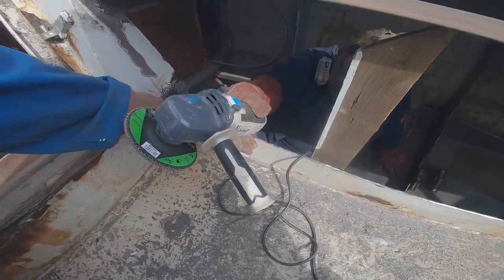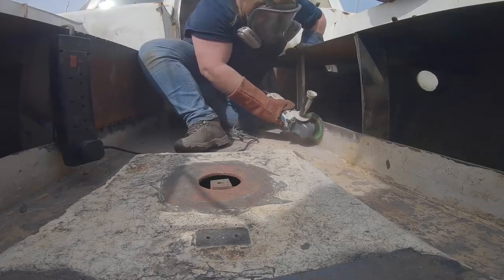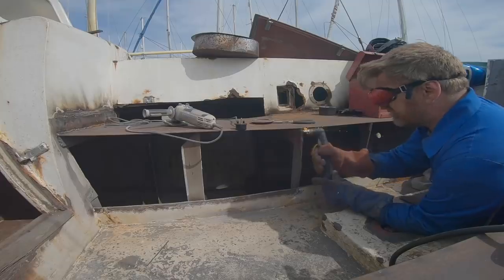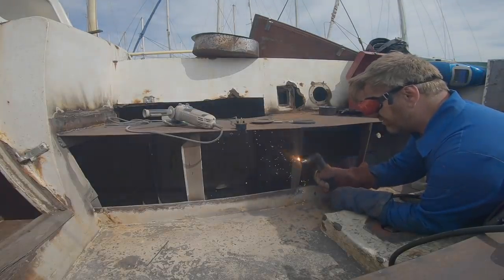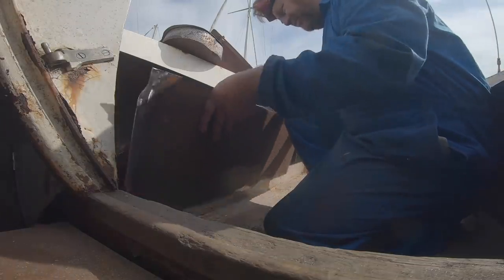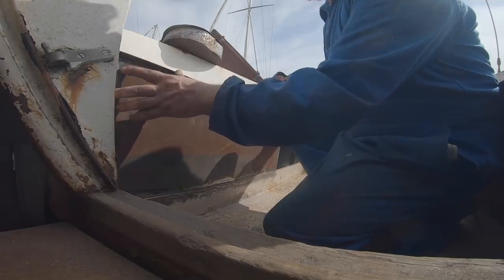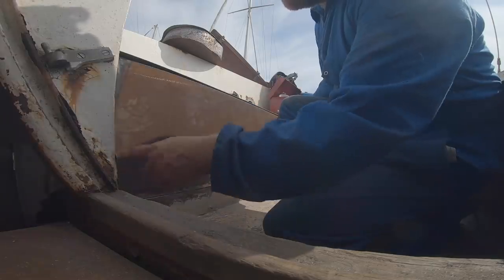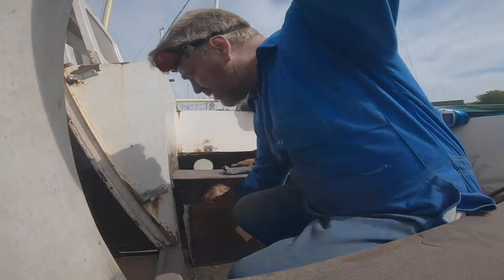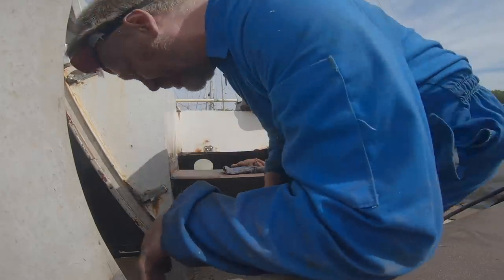So down that red line and down there is the important bit, isn't it? Right, this top corner here. Push it out towards me. In fact, push the whole end out. What we need to do now is lever that up with a screwdriver to pop it in position. Put the screwdriver in underneath the panel like that and lever this up. We'll do it as a test fit, then stop and come out, plug the welder back in, and do it again to tack it in place.